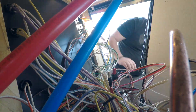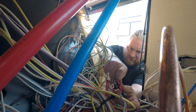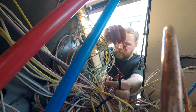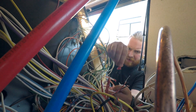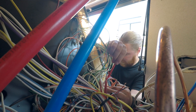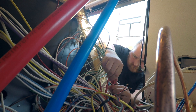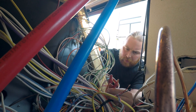For this phase I recommend removing the fuse that comes installed with the optional DC power kit. That way if any wires cross and you didn't unplug the battery, you won't blow that fuse right away — it simplifies the install. Once everything is plugged into the PepWave and you have power set back to the battery, you can insert the fuse and you won't have any issues.